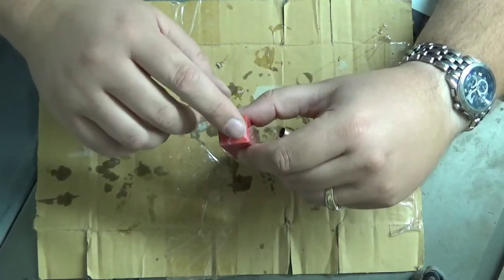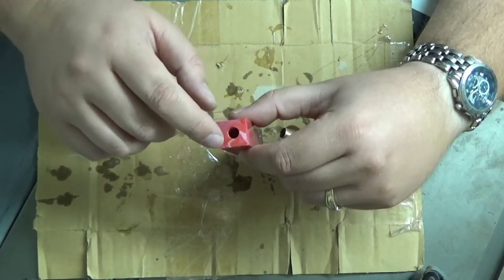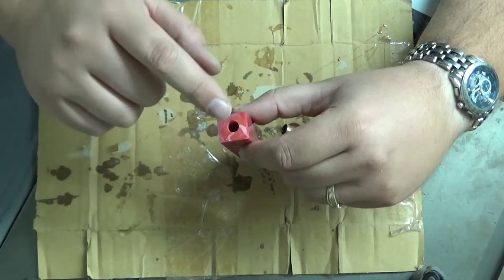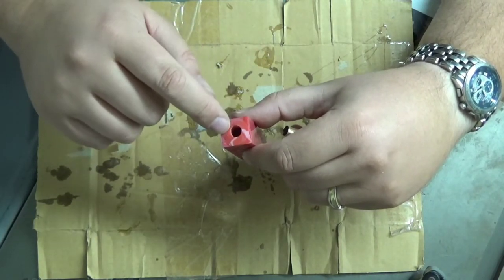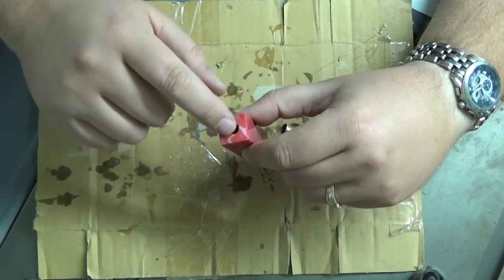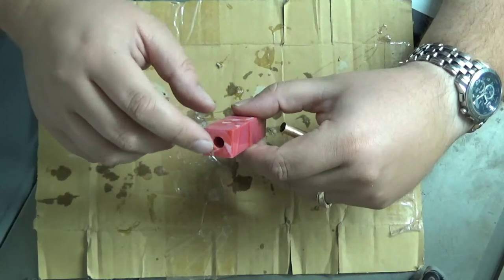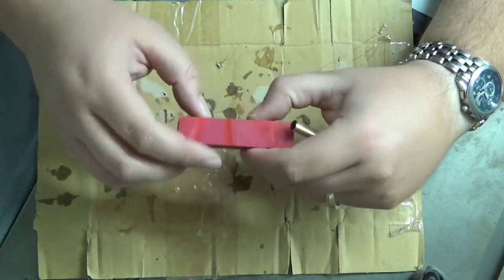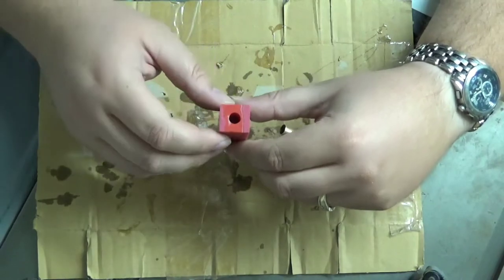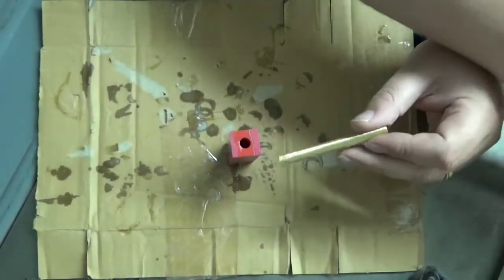And this acrylic, when I got down to the end of the drill bit, I actually ran out of fluting. And so some of the cutoffs were trying to come out the fluting, and it was jammed up, and it caused a little bit of heat on this end. A little bit of melt happened, and so I want to make sure that I don't get all of that melt in there, so I want to have it as close to this end as I possibly can. So I'm going to face that end up and take my thick CA glue.